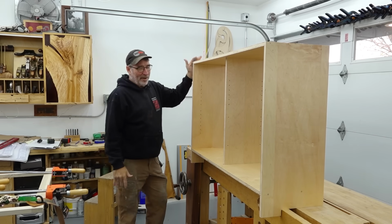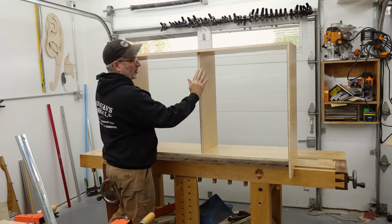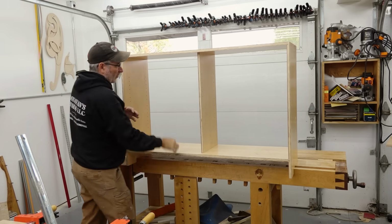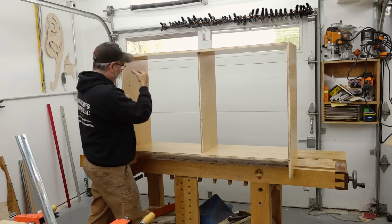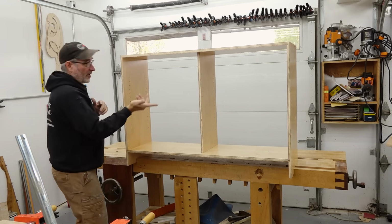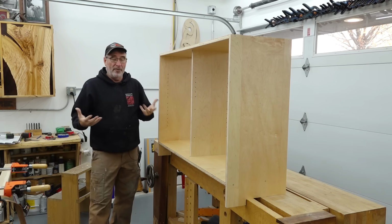So we've got this lower cabinet assembled. We've cut it out on the Yeti. A couple things are a little bit different on this cabinet. It's going to have a double bypass door with the V-groove MDF that we've got. Those will be bypass, so they'll have the grooves in there. That's why this is set back, and then it gets built out, so we need a couple inches of clearance. There'll be a veneer put on here to cover up this and our face frame. We've got adjustable shelves, and they'll be applied back on this also.